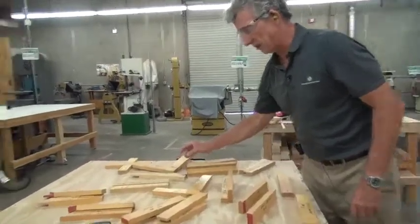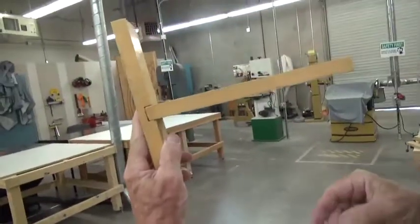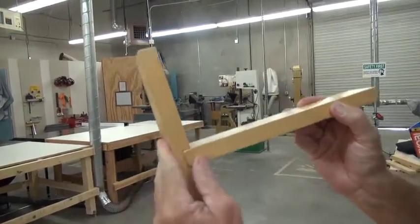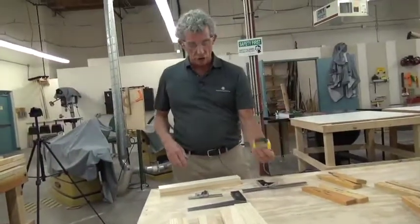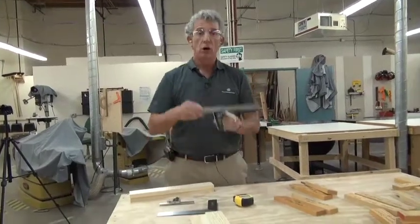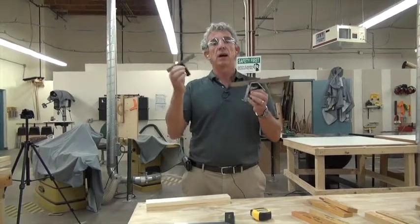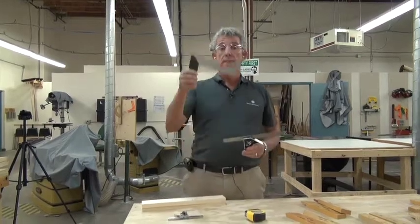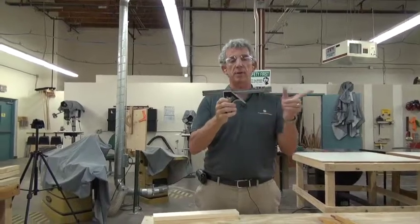The one joint I like — if you put it in on that dado, you're going to notice we're pretty much almost at 90 degrees. It's not sloppy where it's dropping down. You'll be using a tape measure and a square, whether it is a regular square or a combination square. Depending on what I'm doing, it will dictate which square I want to use. If I am going to be doing a miter at 45, I can't use the 90-degree square — I'd be using the combination square to give me my 45s.